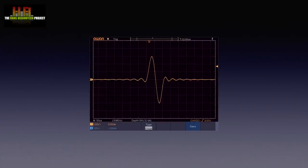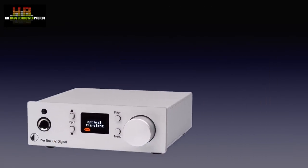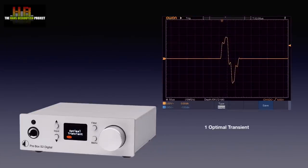But when looking at the filters something strange appeared — something I can't explain, and I'm sure there are people that can. I usually look at filters using a single 10 kHz sine wave at 48 kHz sampling. Due to the band limitations it will give some ripples before and after, as can be seen here. Now let's change the filter to the one Pro-Ject and I prefer: the optimal transient. This doesn't look like anything I put in. The single sine wave is constructed in the DSP and could never occur in a digital stream as such. That might be the reason there is no correlation between what we see and what I have heard. And the filters I liked less — with the exception of one — all look better.